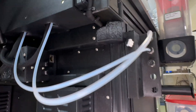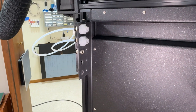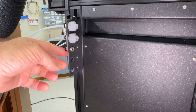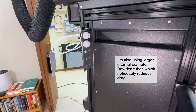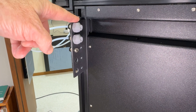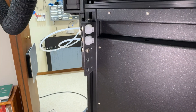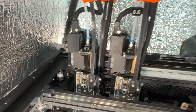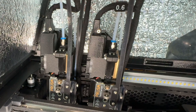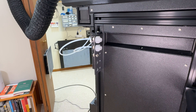My filament sensor wire is just hanging here because I do not use the external filament sensor — quite a few people in the community don't. I got rid of it. It was a pain because it was hard at times to get filament through it and it created drag on the filament. I don't want the printer to sense it's run out of filament there, stranding a very long length of filament in the Bowden tube. I want that to happen at the printhead, at the second filament sensor. If I'm doing an auto-join switching to the other printhead, I've wasted almost nothing. If I need to swap it, I just pull the Bowden tube from the top of the hot end and retrieve that little bit of filament.